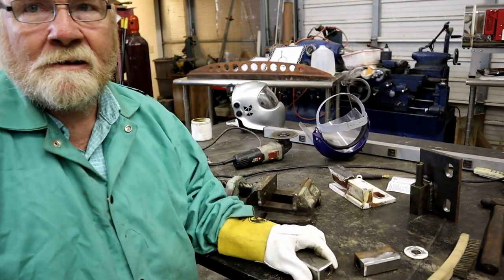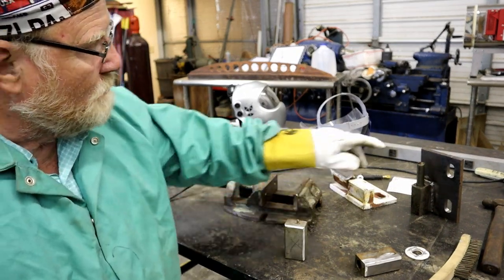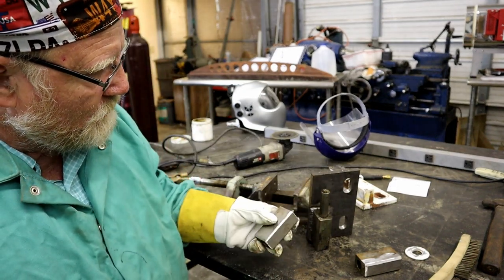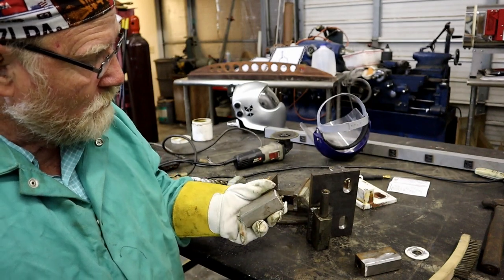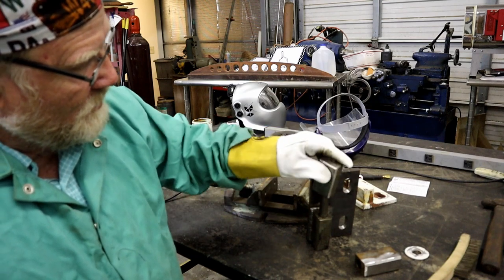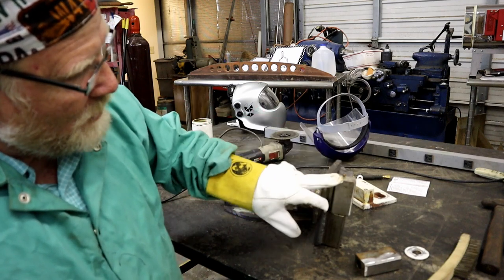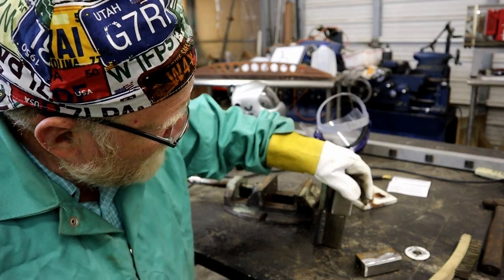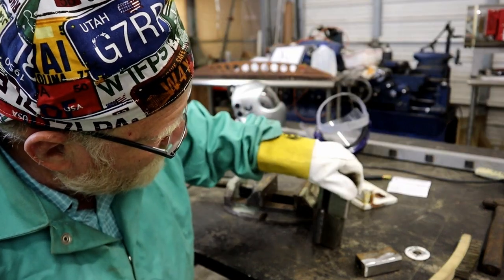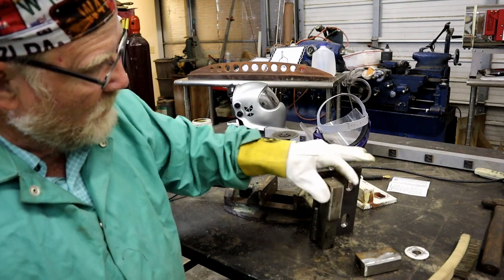Alright, got it kind of all ground out and ready to go. This is the piece that goes to the pin on this hinge. Remember, I said you couldn't put very much metal in there because of clearances. I've also found that usually these pieces, as they're rotating, don't have enough clearance on those corners. So I always grind them off so they have a little bit more clearance, and when you grind that edge, it won't rub on any weld or paint. They usually get painted four or five times and it builds up pretty good.